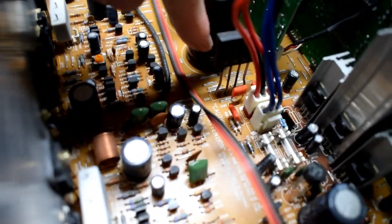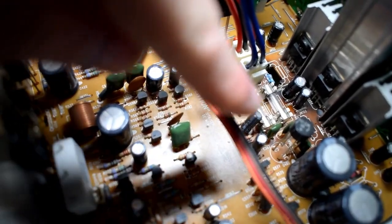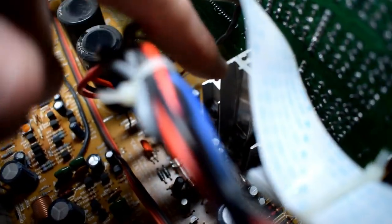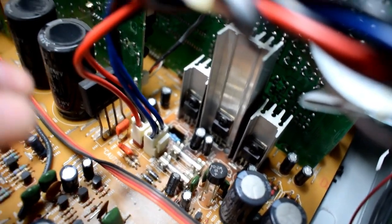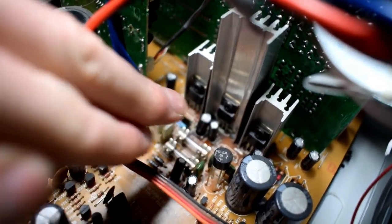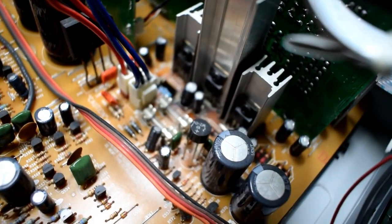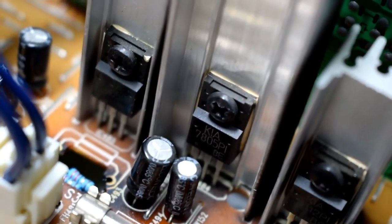This will be a rectifier for the AC, and you have some fuses. The problem was these are actually voltage regulators — these two left ones are 5-volt linear voltage regulators. They are 7805s. Trying to zoom in so you can see — it's a 7805 there.